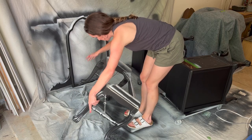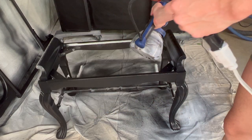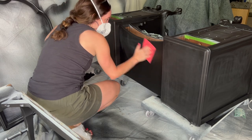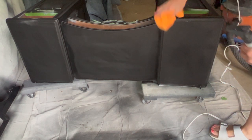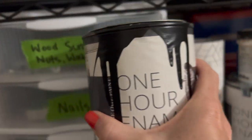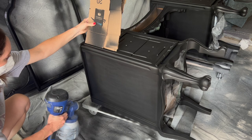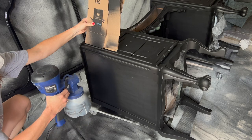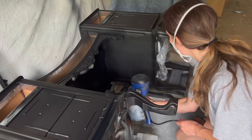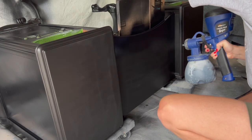Once dry, I flipped over the stool to coat the top — one coat was sufficient, making a total of two primer coats. Before moving on to paint, I'm sanding down the primer with a very fine rad pad to give me a really smooth finish. Rad pads are a great hand sanding foam pad made by Surf Prep. Just like I did before priming, I'm wiping down with 50-50 water and denatured alcohol to remove any sanding dust. For paint, I'm going to be using Wise Owl One Hour Enamel in Jet Black — I love this paint so much, it does not require a top coat and is super durable. I'm following the wet line and overlapping by 50 percent with each pass. Here I'm using a piece of cardboard to block overspray from getting into the drawer pockets.